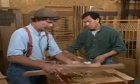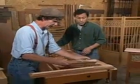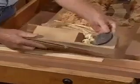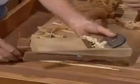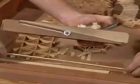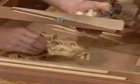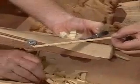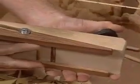There's a track for it and skates on it and all kinds of things happening here. This is a very special plane that's really no longer being made. The person who makes the bodies for all of my planes made this for me as a gift. It's a special plane that's made so that you can very precisely thickness the tiny little bars that I use for that very, very fine grid work. So this is set for the thickness plus this.